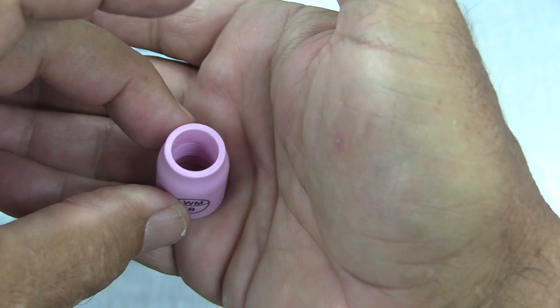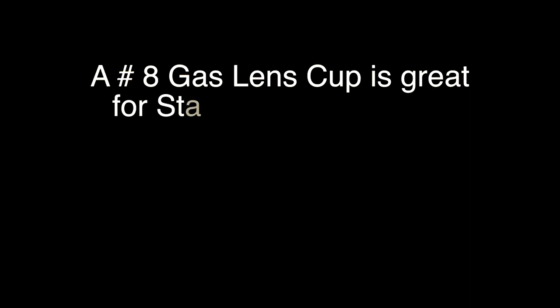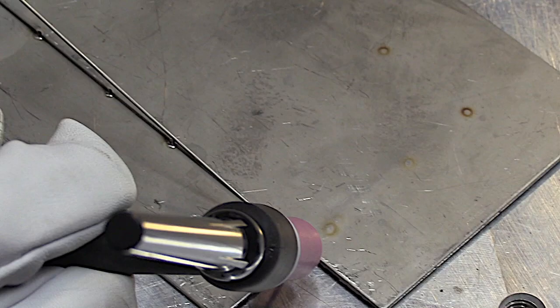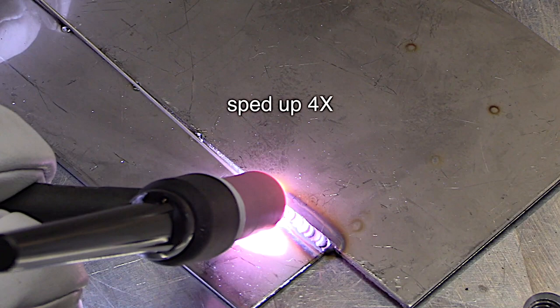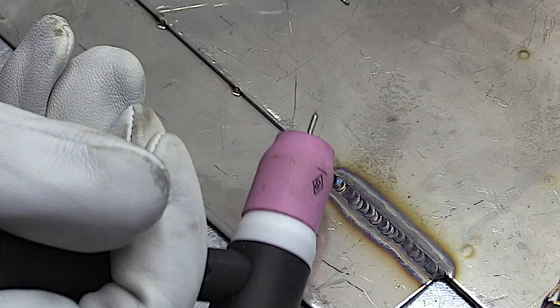And then there's the number 8, which is kind of a really good all-around cup for stainless, chromoly, and carbon steel. This little demonstration really shows the difference between the standard hardware that comes with a TIG torch as opposed to a stubby gas lens. I'm using the same long stick out — half-inch stick out — and I'm going to use the same stick out on all these cups. This is sped up 4x, but you can see it's just kind of squiggly. I'm losing shielding at that stick out at about 20 CFH.